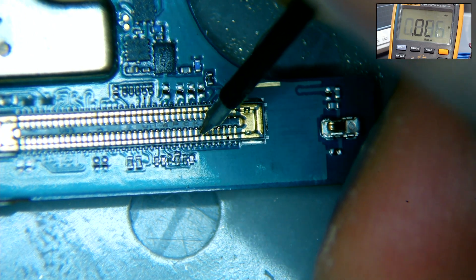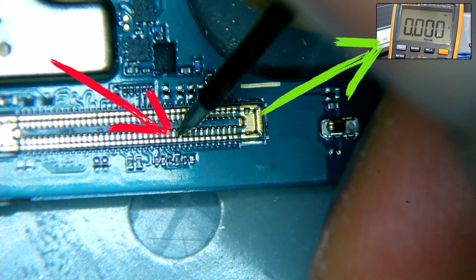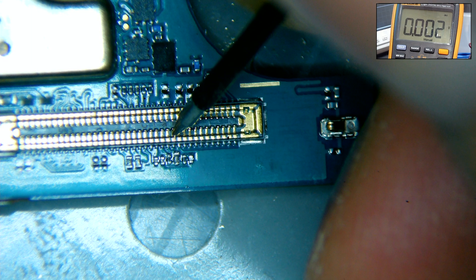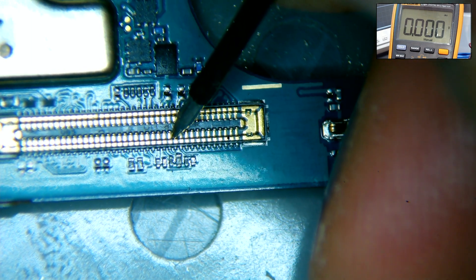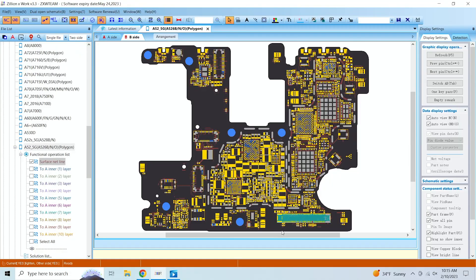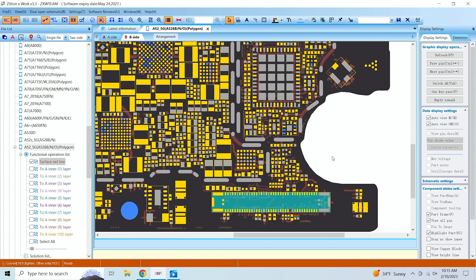As we check, many pins are producing 0.296 volts. But we reach one pin that shows ground, and the pin right next to it is also showing ground. We know this doesn't add up because the diagram did not show two consecutive grounded pins. Therefore, we know the issue lies within one of these pins. We go back to the diagram and see that this pin is shorted to ground and it's not supposed to be.